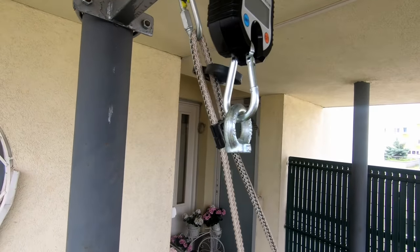Well, if you are using the bolts or these threads just to hold two pieces together without a big load, then you can use them printed in vertical position. But if you are expecting a little bit bigger load, then it is much better to print them in horizontal position. How big a load? Well, wait for my video where I will test M3 to M12 bolts, and that will give us approximate information on how strong they are.